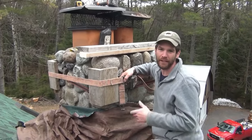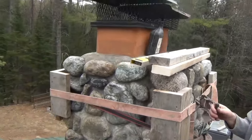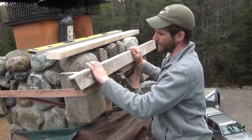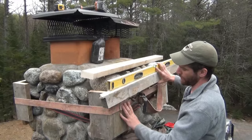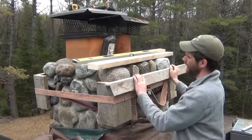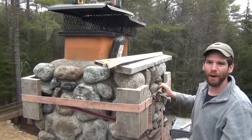This is the trickiest part — you're trying to build carpentry on a big masonry mess. The trick we found: take pieces about 12 inches long, two-by-something, screw them to each other, put one on each corner, get a ratchet strap and crank them together. Get them roughly level, then take any old two-by and get that dead level. This top will be screwed into these — and it's amazing how much friction you get when that wood squishes right around the stone and holds tight.